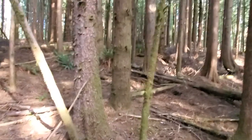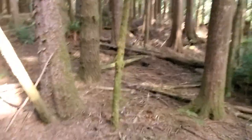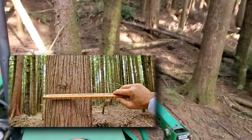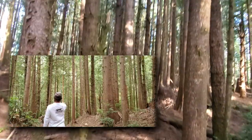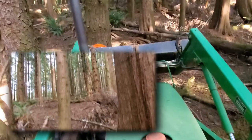We can measure a tree's diameter and simply estimate the height. The 28-foot log for the beam will be hardest to find, so we'll look for it first. The diameter can be measured at eye level and then estimated about 28 feet up. It would be nice to find a log that tapers no more than a couple of inches from one end to the other.